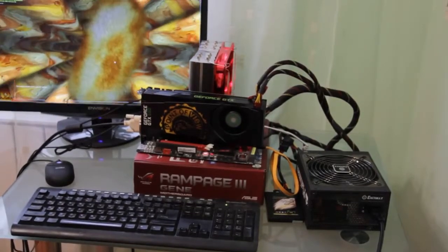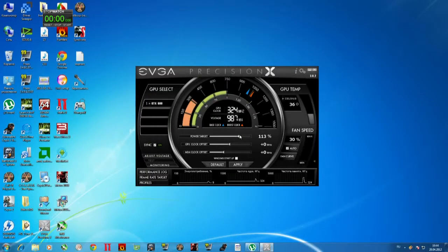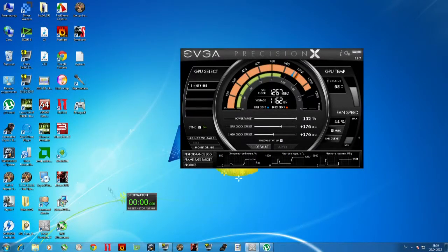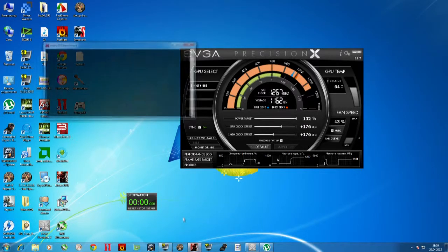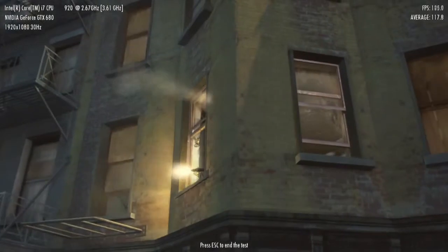Now let's overclock it using EVGA Precision X software, with default core frequency equal to 1006 MHz. Frequency went up to 1273 MHz, including our manual overclocking and GPU Boost feature. A 20% add-up is perfect for a flagship video card. The new 28nm processor really works miracles. However, memory overclocking wasn't positive, and it seems like 6008 MHz is enough for everything. We slightly overclocked memory by up to 176 MHz in the same way as the core. All cards are tested under overclocking to see their maximum possible performance.